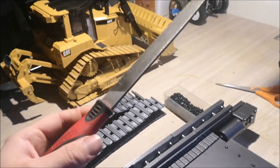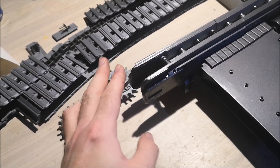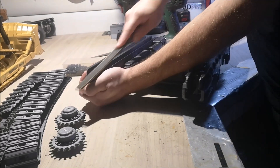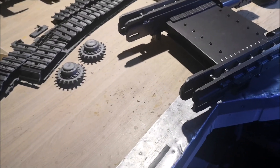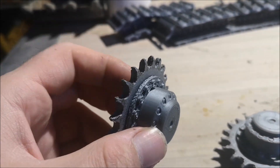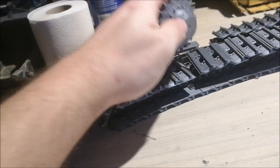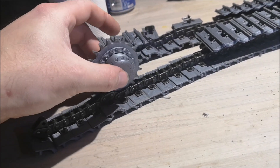While using this file, I remembered that the tracks were rubbing against these, so I'm going to trim down these as well on both sides. Hopefully that's enough to keep the tracks from rubbing. Here's why I trimmed down the sprockets — as you can see, the teeth are now pointed. That means they will mesh much easier with the chains when they go into the grooves.